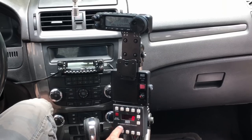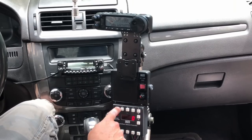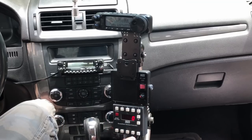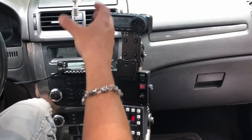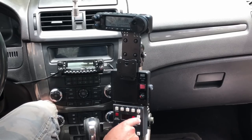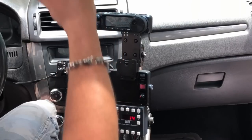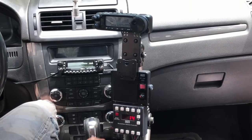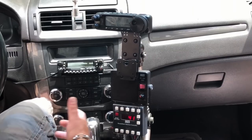Controlling the Tarheel requires an external screwdriver antenna controller. The one I currently have basically controls up or down with 10 buttons for memory presets — there's no RF sensing. I do have an RF-sensing model to swap in that will track the radio frequency better and adjust the Tarheel automatically. With the current one you push up or down, see the numbers climbing as the coil raises, or save presets and push a button to automatically move to where you've had the antenna tuned for resonance. Very simple.